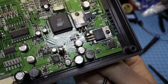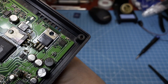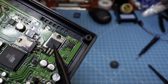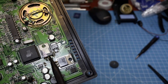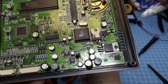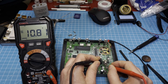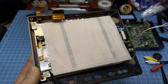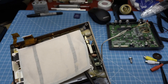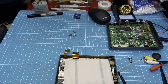Now I'll check where I can get my 12 volts. This here is a 7808, so that's 8 volts. Let's check what this is — these are 11 volts. Yeah, I think that should be fine.